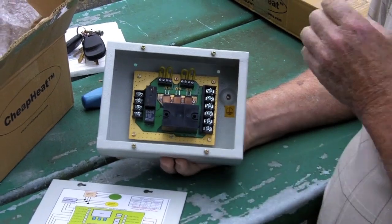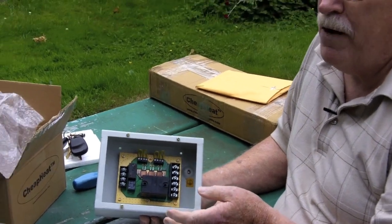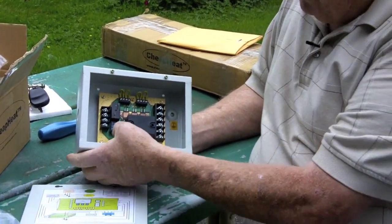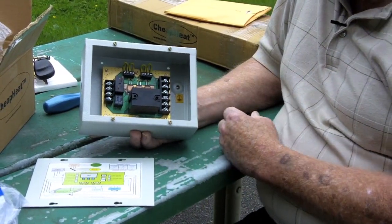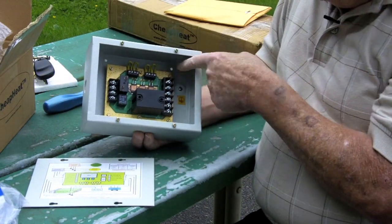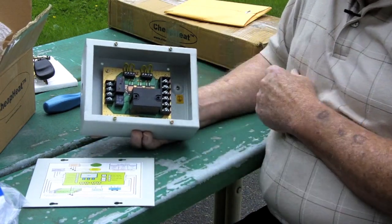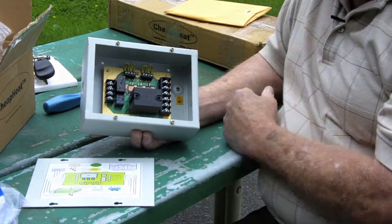All of the circuitry in this thing is oversized by 30 to 50 percent. For example, the average fan in a furnace is going to run somewhere around 10 to 12 amps — that's a 20-amp relay. Just for the thermostat control, that's a 5-amp relay. The thermostat — most it can run is 1 amp. You can see the size of the runs within the board in the brass inlays, just how thick this thing is, and then everything's grounded — it's all grounded to the box, all the way back from the controller to the heating element.